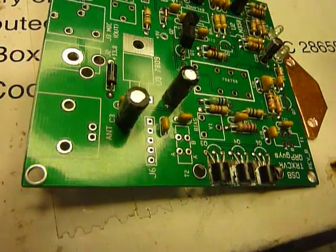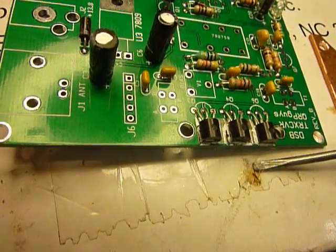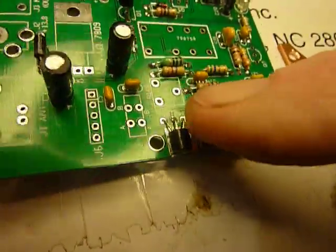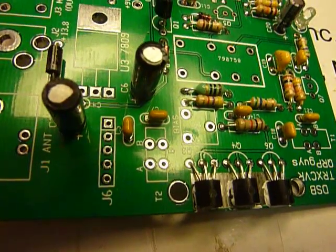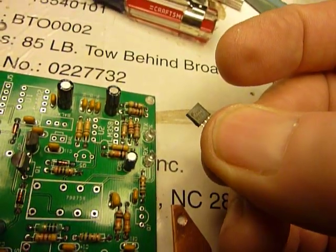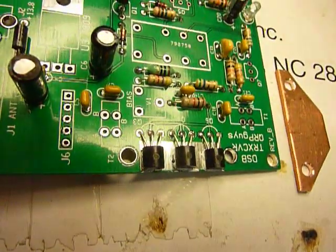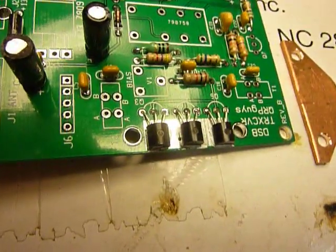Before I put the alligator clips on, I took this little screwdriver and lifted each transistor up and put a small dab of white heatsink compound underneath each of the final transistors. All three of these final transistors are BS170s and they're all in parallel. I also made sure that each one of these BS170 transistors — you can't see it there, but if you take a magnifying glass you will see they are all of the same batch, so I wanted to be certain that these three finals were all of the same batch because that way their characteristics will be as closely matched as possible.